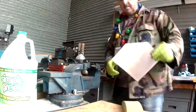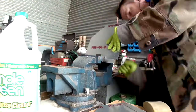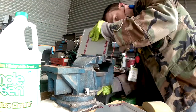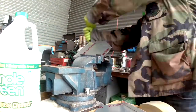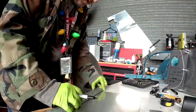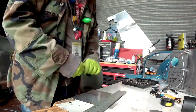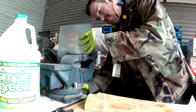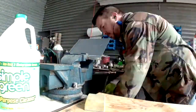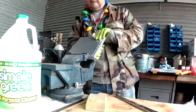What you see me doing here is making the actual sides — two for each side — bending two flanges on a piece of metal. Unfortunately the brake I have isn't the right size, so I have to go back and forth until it gets to 90 degrees. Those two pieces will sit on either side of the G3X display and a shelf will be attached to both ends. I've run out of spare metal so I've ordered more.